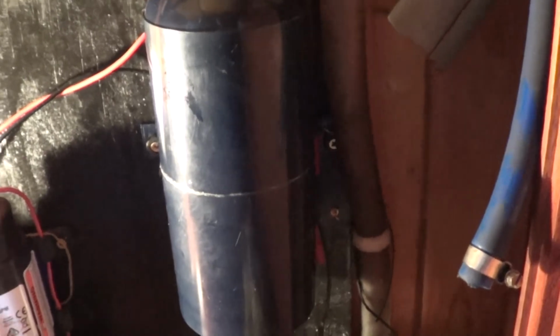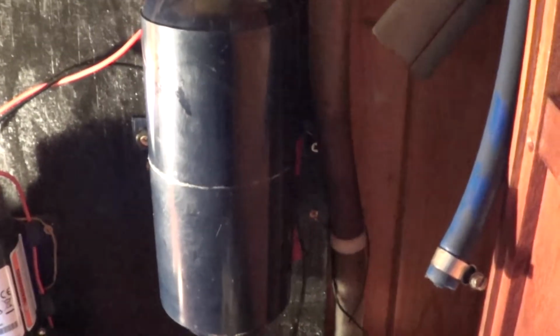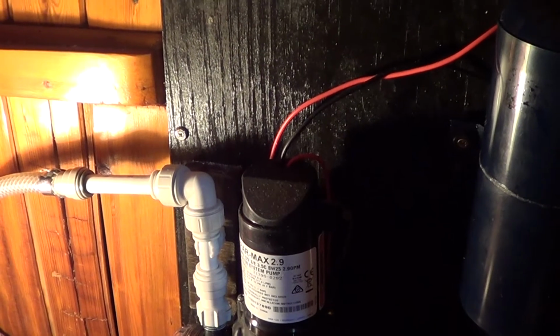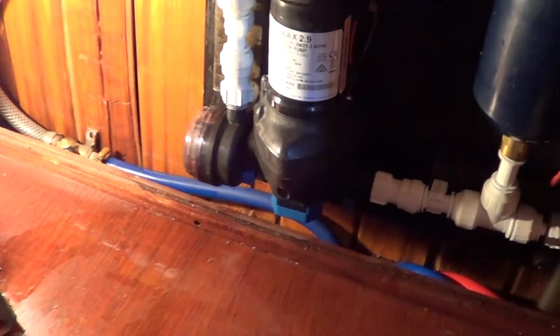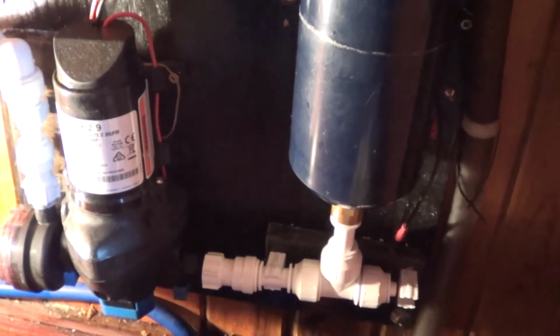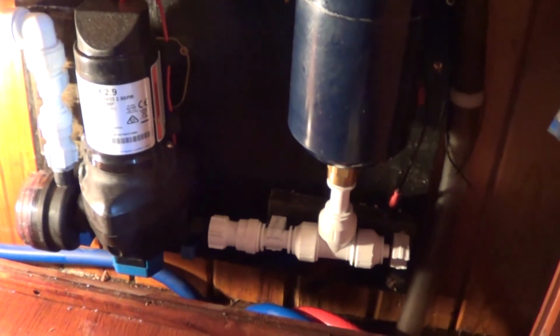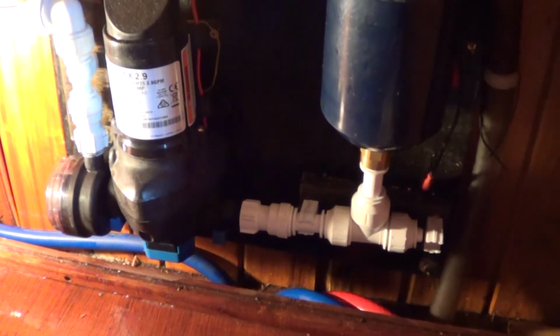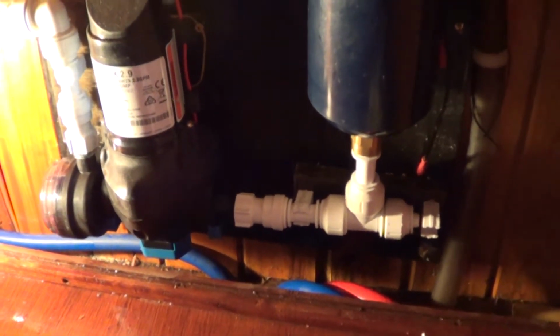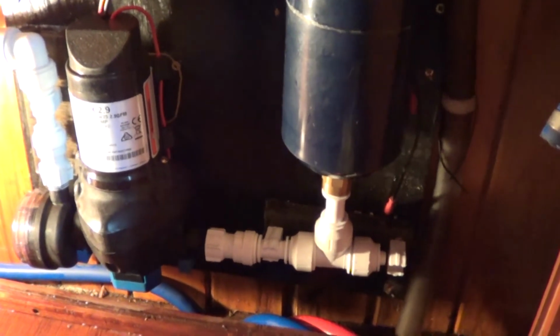I have just connected the pumps, the supply from the tank back up to the pump, because there is still water in the tank. I shall tidy all that up eventually. My intention is to get the pump running, get a bit of pipe on there, and probably even get the new kitchen taps on and get a cold supply to the taps there, and then drain the tanks right down. I want to flush them out and clean them, because they've had some of this antifreeze that you can use in drinking water. Over the year, when I first fitted them, it still had the Paloma water heater then, and in the winter there was no easy quick way to drain this system down.